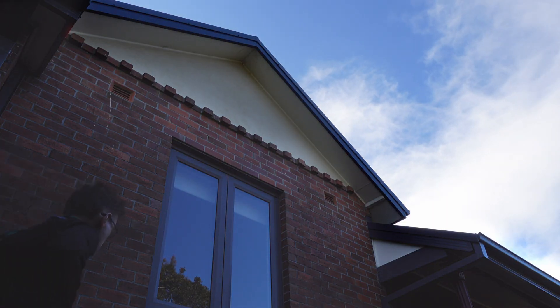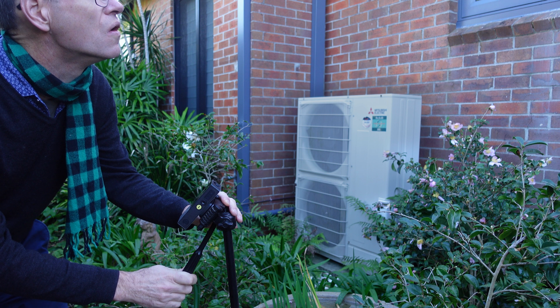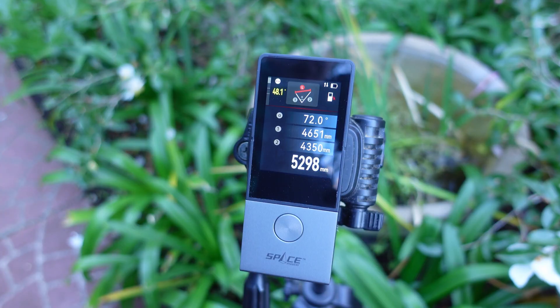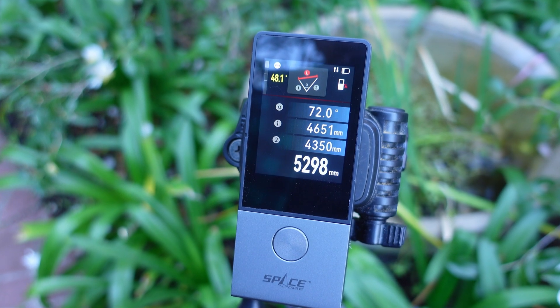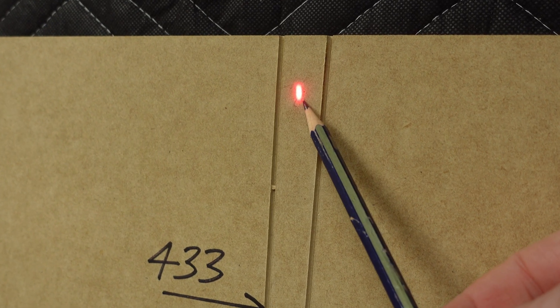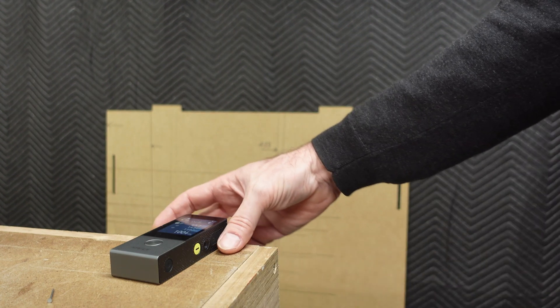Point to point is a great feature for when you can't physically access the thing you want to measure. For example, let's say you wanted to measure the distance across a gable — it's not practical to set up a ladder and perform the measurement quickly. Using the point to point feature, I can simply aim the laser at both ends and take the measurement. To do this accurately I'd also need to use a tripod and the self timer to keep the D9 Pro still. This could work well for approximating the area for painting that space. But what if I needed something super accurate? That's where you need to consider how well you can actually aim the laser, and that's not a limitation of the D9 Pro — it's a limitation of how well I can position and aim the measurement. If you look at the laser up close, you can see that it doesn't have a pointy end like a sharp pencil, so just where exactly is this thing measuring from?